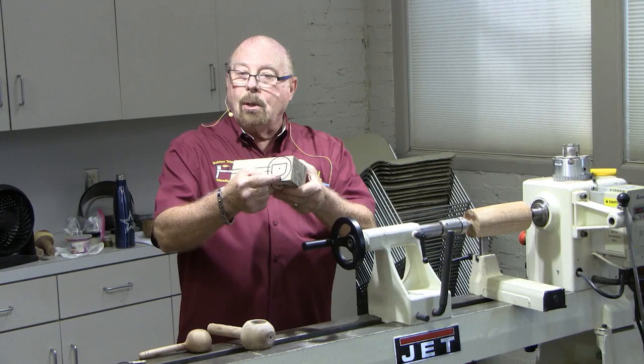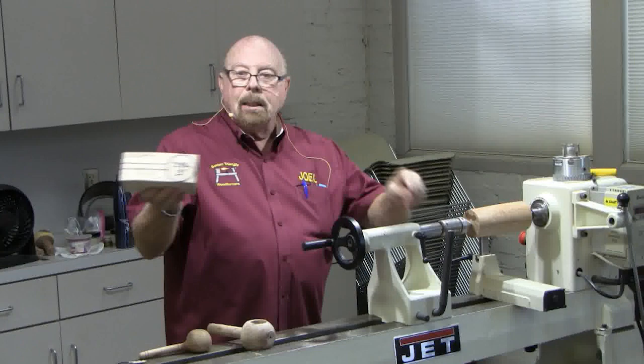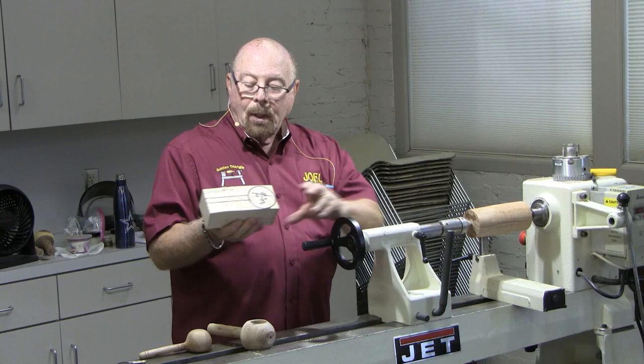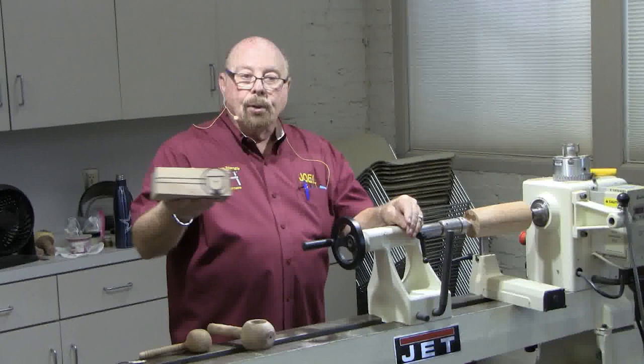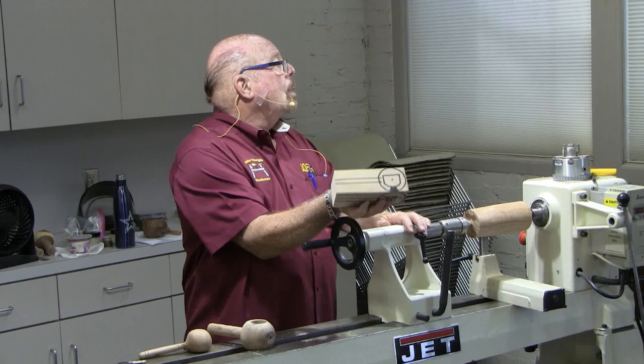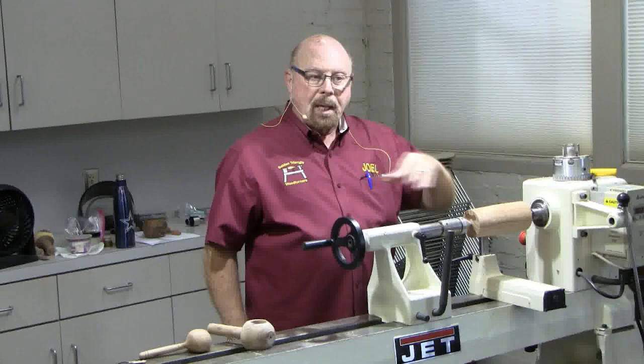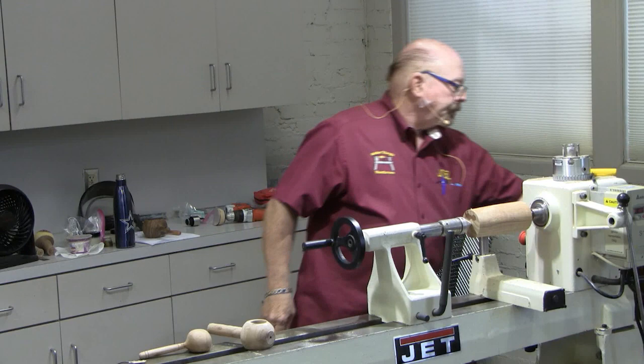What I did is figure out the size of the scoop I want and draw a little tenon on the bottom. I drew a circle around it and found I needed about a three-inch circle of wood to incorporate the tenon along with the coffee cup. I worked out the whole process to turn the tenon away. I started with about a two-and-a-half inch cylinder, then decided I needed a little more room and ended up with a three-inch diameter cylinder about seven inches long.